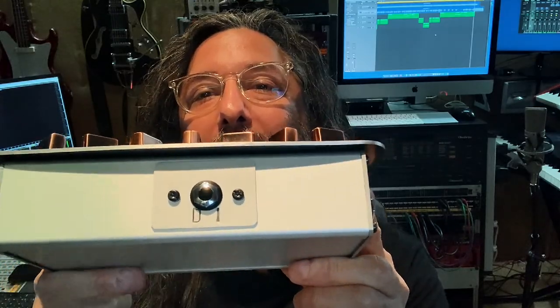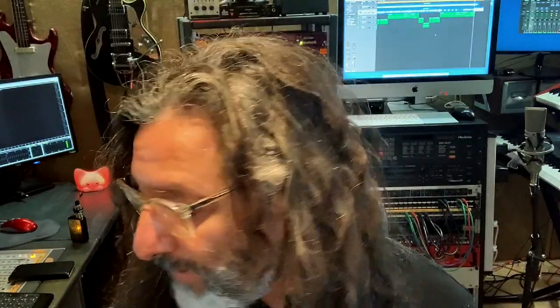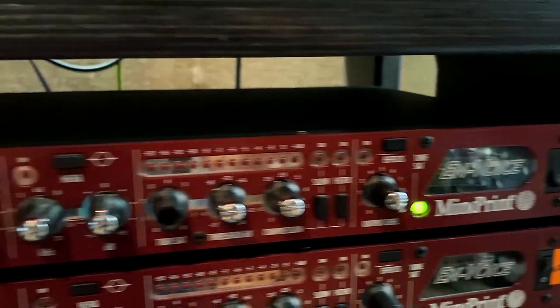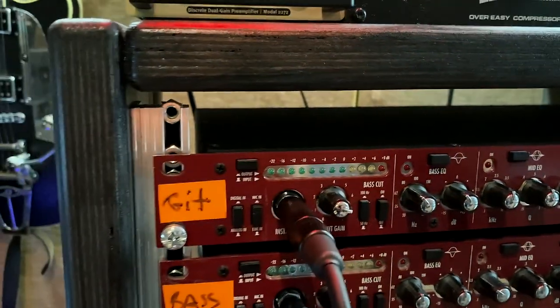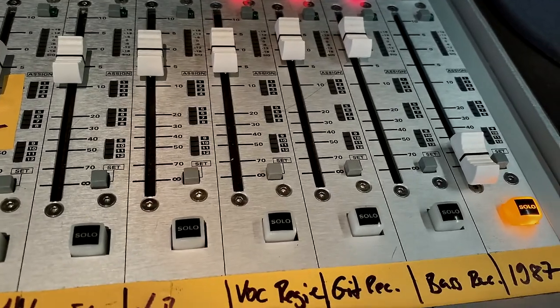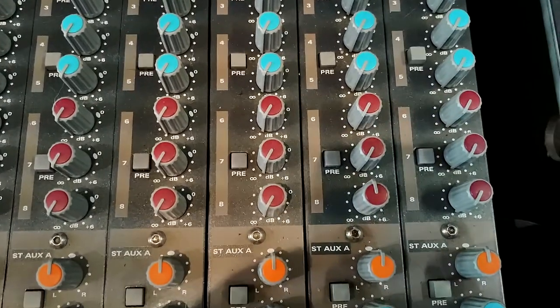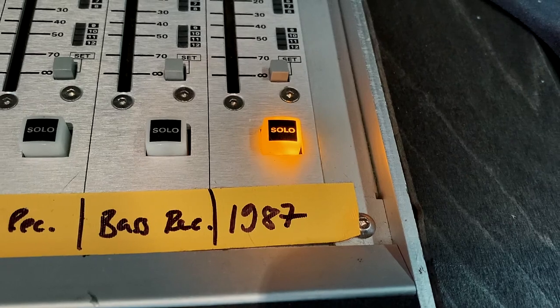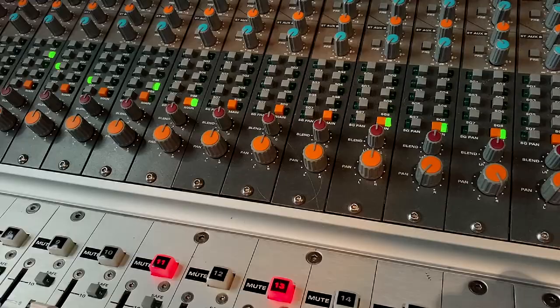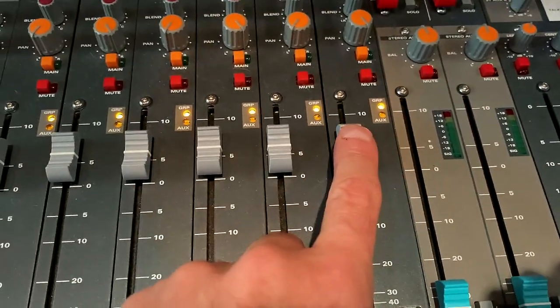This is my customized output which basically goes directly into my DAW or a channel of the desk. The guitar goes into the Mindprint On Voice Pre, which gives me the possibility to compress the DI signal and do some frequency correction if needed. This goes into a channel of the Audient desk, from where I can play the guitar and feed the reamping box on AUX 8. From AUX 8 it goes into the Red Stuff 1987, and from there it comes back onto another channel of the desk, which I route to a subgroup 8 in my DAW.